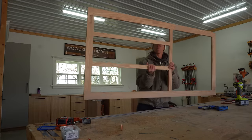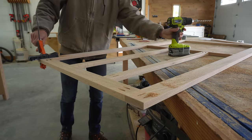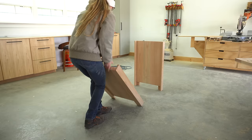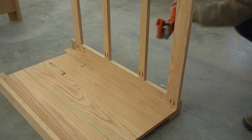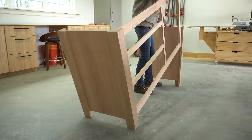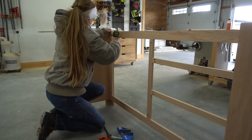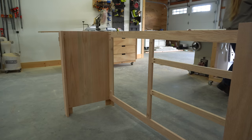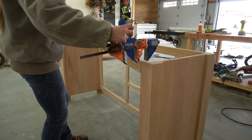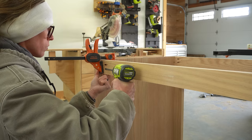After the frame was assembled I realized I forgot to drill pocket holes into the ends of the top and bottom boards to attach it. So I went back and drilled these, then secured the frame into the side panel with pocket hole screws. I attached this frame to each side with pocket holes, but also came back and added a couple of screws through the sides of the frame to secure it to the front part of the legs. Had I been confident in the design I would have also used wood glue along the front — I recommend doing that.